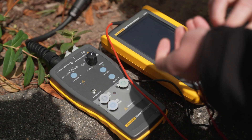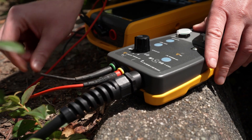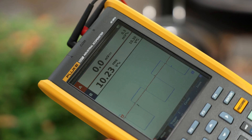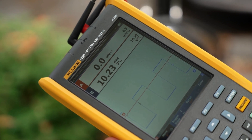For advanced testing, use a scope meter. Connect it to the CP signal output terminals of the charging adapter. Turn the switch to position B — this simulates connecting an electrical vehicle. The connector is now locked, and a pulse width modulation signal appears on the scope meter.